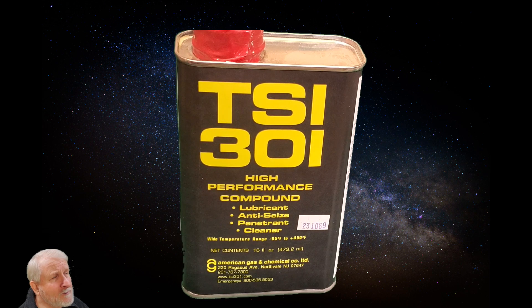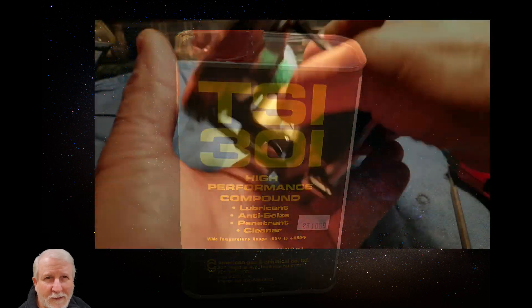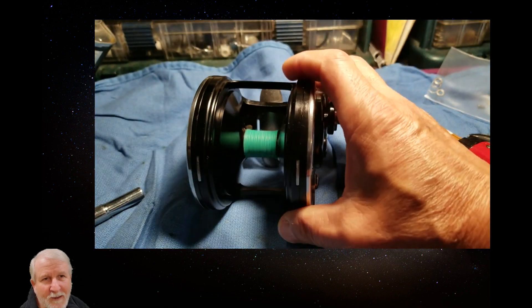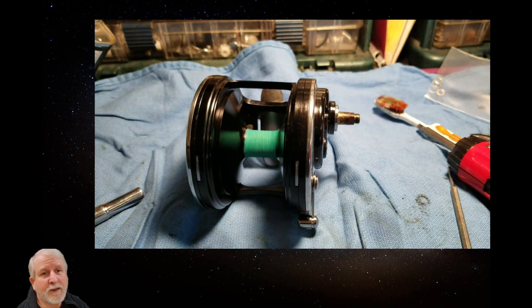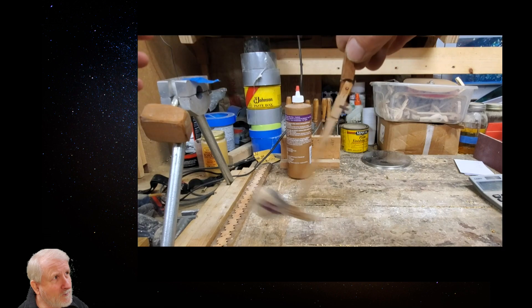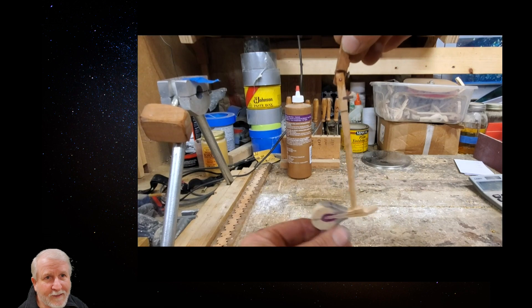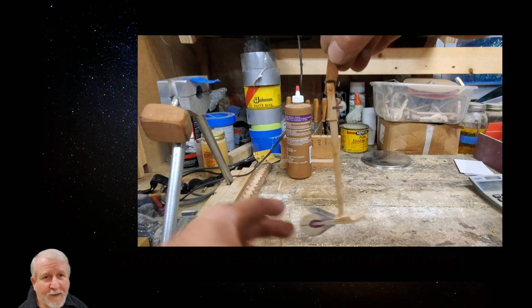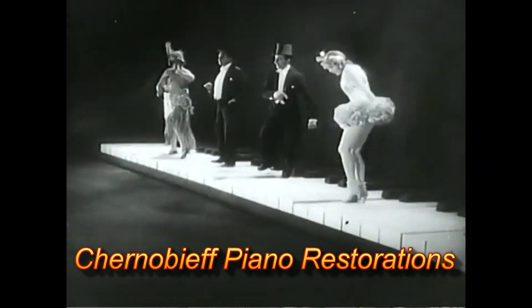When it comes to action centers in a piano, there are really two problems: one is that it's just too tight and needs to be repinned, and the other is a contaminant problem. This fixes any contaminant problem for sure. As you saw in my other video, I had a hammer that went from three swings — I put a couple drops on it and it went right back to about seven to nine swings. Absolutely incredible stuff, and here it's a month later and it's still great.